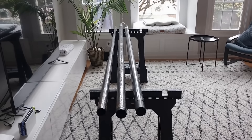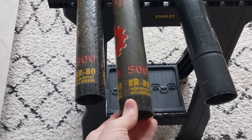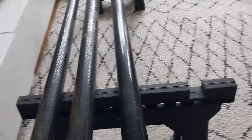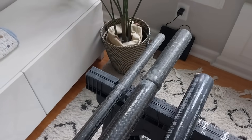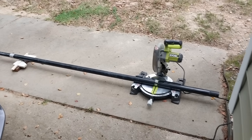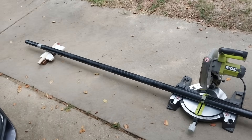These are the main components of my mast. I've got one full windsurfer mast here which is five meters or sixteen and a half feet. Then I've got an additional bottom half section from another mast — I'll cut this one shorter and insert it in the bottom of the mast to the left. On this end you can see the inserts that attach the sections together. The first step is to cut the bottom section to 1.7 meters or five foot seven.